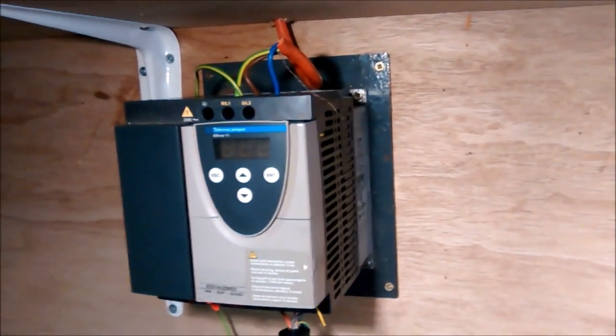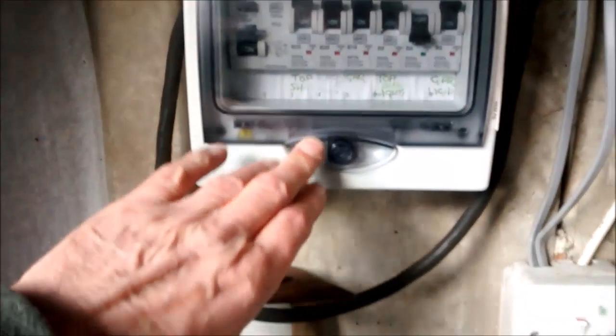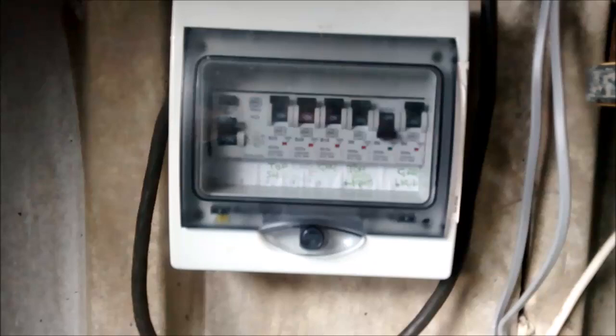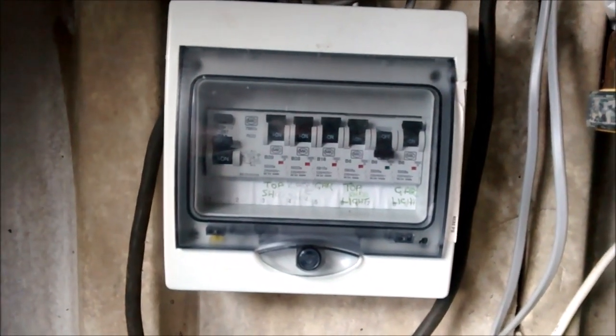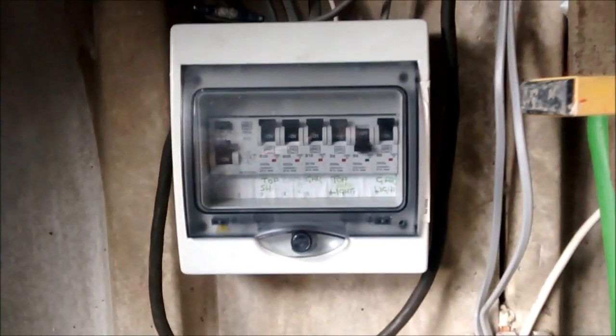And it's a 60 amp breaker, I think, back in the house where it was tripped. And this breaker here, 63 amp breaker. Let's just push to test. We'll push to test. Yeah, I've got 63 amp breaker, which is what came in here, and so if the 60 amp breaker in the house is... yeah, the 60 amp would go before the 63, I presume, as if there's some sort of short circuit on it. So